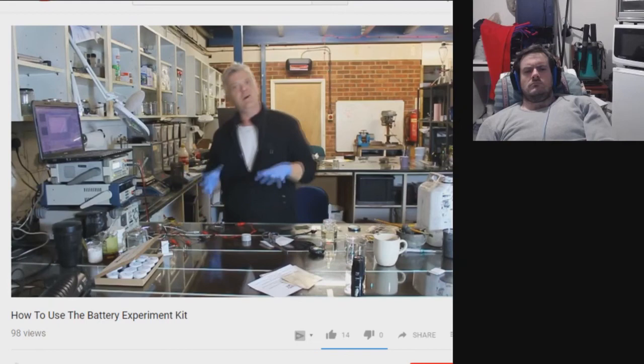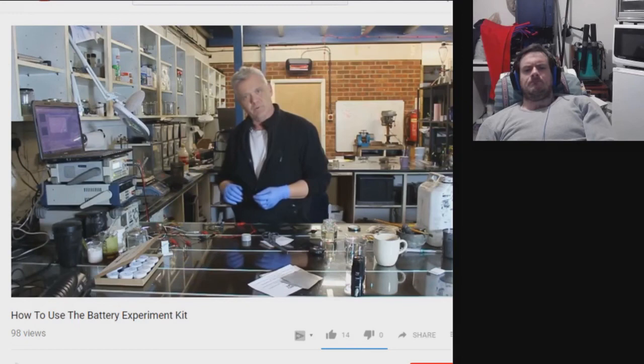And when you're guessing on it, 2 volts is a guess. Have a look, see if it bubbles. If it's not, back it up. If it is, turn it down. Once you get to about 1.23, it's going to start bubbling, exactly below the reference potential of most things. The other thing is to look up the reference potential and calculate what it is.